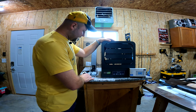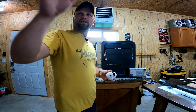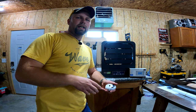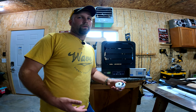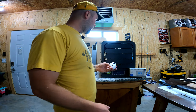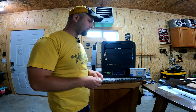The other piece that makes this unique is the addition of this little temperature sensor. It comes with a bracket and screws and you can place it anywhere in the house. This allows you to keep your working area at that optimal temperature. Say you're working in the corner of the garage and it's colder over there — you just take this sensor with you, set it next to you, and the heater will run until it gets that part of the building to that temperature. If you're working right next to the heater and it's too hot, this will sense that it's warm and won't overheat you. Or if you're across the garage where it's cold, it will run until it gets warmer over there. It's measuring the ambient temperature in the room, reporting back to the heater, and automatically adjusting it so you stay at that temperature in your area.